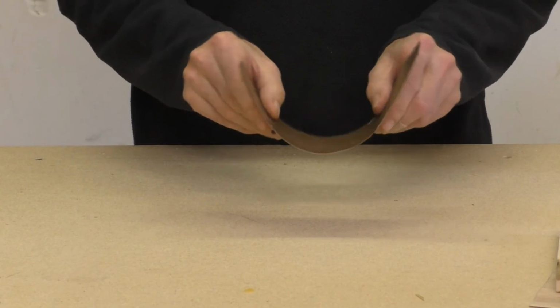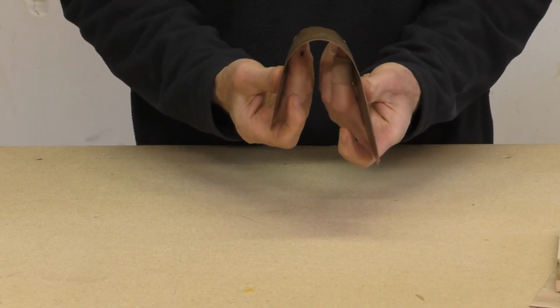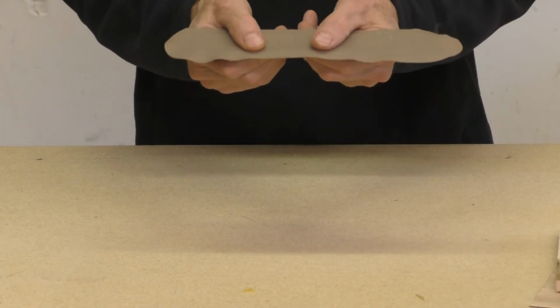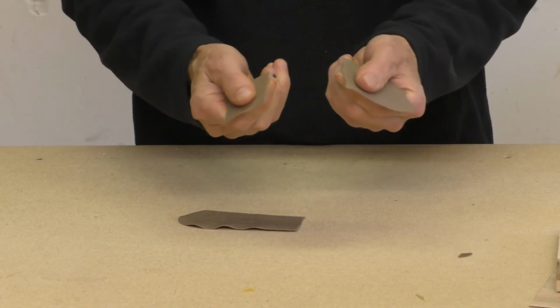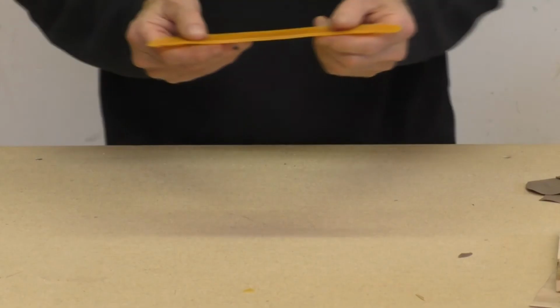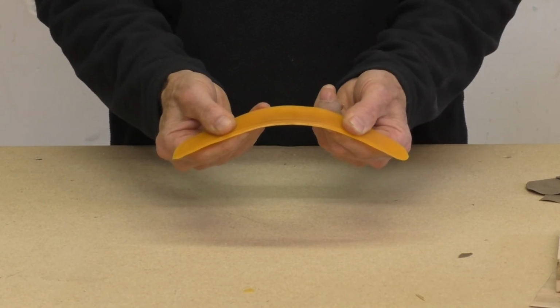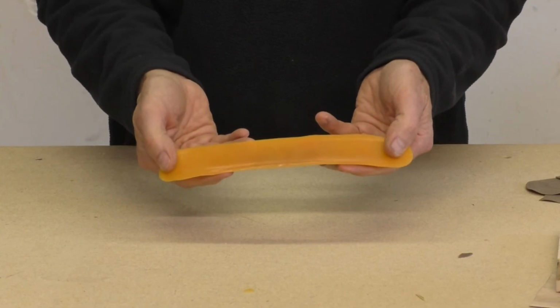Here's a particularly soft one, surprisingly marketed for veneering. I would not use this glue on my veneer. Here's an extra hard one that I developed. Not as rigid as a urea resin, but still pretty darn hard. Here's one that has a waterproof rating. Note that it is still in the mid-range of hardness. The additive that makes this PVA waterproof does not make it any harder.